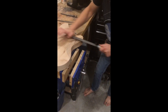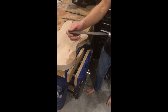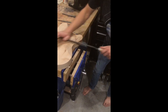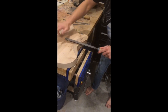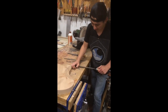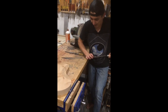All you need is hand weight and a nice sawing motion — meaning not back and forth straight, and definitely not this way. You want to utilize all these teeth. So this is a half-round rasp, and I really like the round side. I use the flat side when I'm carving necks to have that surface area. You want a sawing motion — a diagonal motion. I have hardly any grip on the handle; the meat of my palm right under my thumb is what's holding the end of the rasp. No need for a handle. Just really light — no muscle. All it is is gravity and this sawing motion. So if I show you this over the edge of the bench — I'm not doing it straight forward, I'm not doing it sideways. I have it at a diagonal, about 45 degrees, and I'm both moving it forwards and sideways in a nice sawing motion.